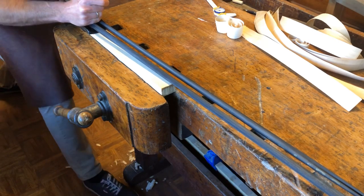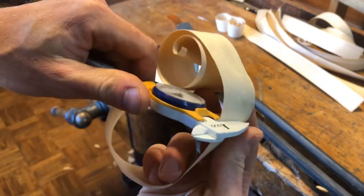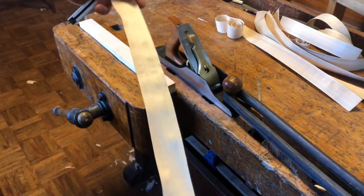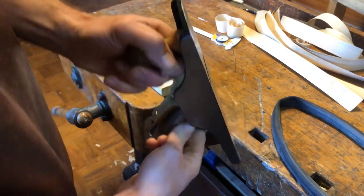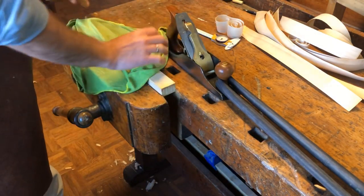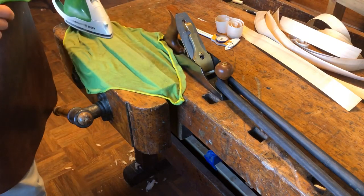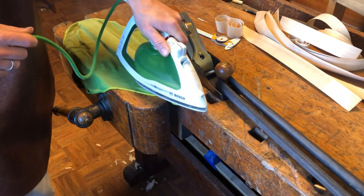Pressure down nicely in the middle. This one is still too thin — let me measure. It's 0.5, so five tenths of a millimeter. I want to have six tenths of a millimeter. I'm going to turn my plane a bit higher. Always give it a nice steam. Doing this by yourself, I'd recommend it only for a few shavings — it's quite hard. Don't expect to do this half a day, but for a few shavings it's okay.